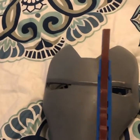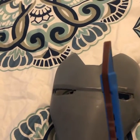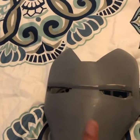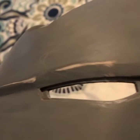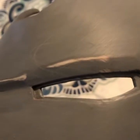So I have found this tool here, which is a sanding pen, and I will leave a link for this in the description. Does an awesome job. They offer different grits. So this is 80 grit, and then I'll swap over to 220. But you can see here just how great of a job it cleaned up that eye. It really got a lot of that stuff out of there, and then I'm hoping a couple layers of filler primer will smooth all that out. But that is pretty good.